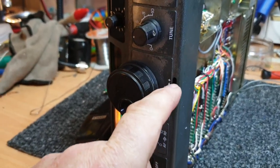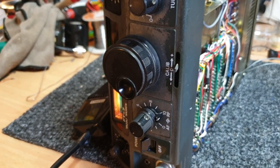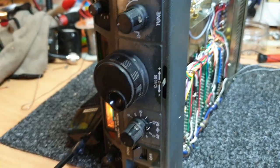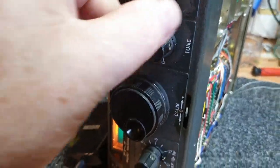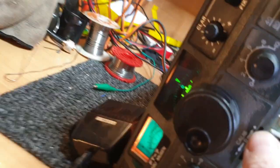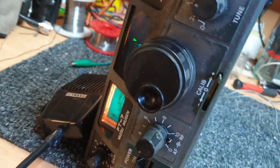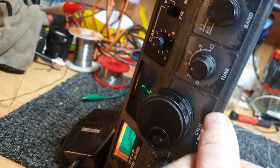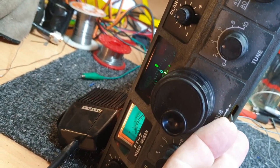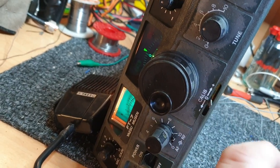Clean out your calibrate controls - they can get a little bit nasty at times. You'll find they can be quite an annoyance in the fact that they get dirt in them, and because they have such a fair bit of swing in them. If we go back to 7.1, let's have a look here with a generator. As you'll see, the calibrate swings quite a way from left to right. See how that still crackles away a bit there? Yeah, we've still got to put a bit more Deoxit into that.